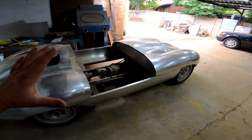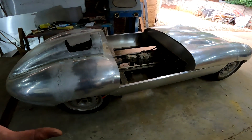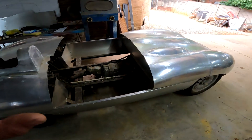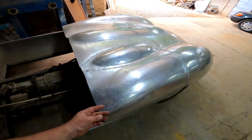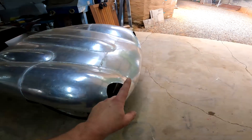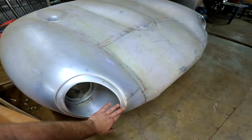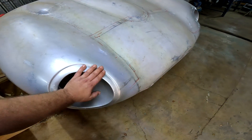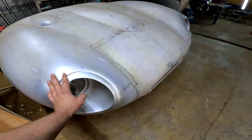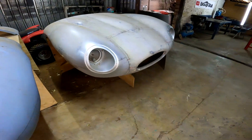I've only now made the basic shapes of the shell and there's a lot of finishing that needs to be done for it to become a car. These edges need to get finished off, the wheel arches need to be finished off, and by the lights we need to make those indentations — like on this mold — where the polycarbonate or glass is going to sit. To make these edges, there is a tool that will make life much easier, and that is called a bead roller.